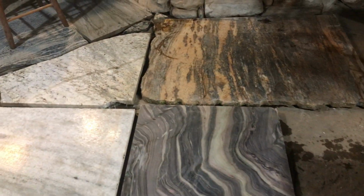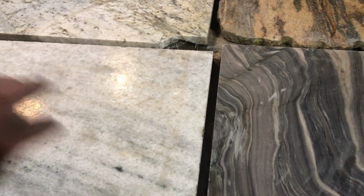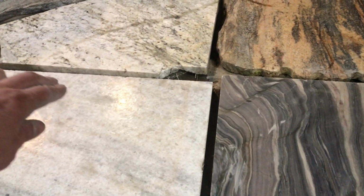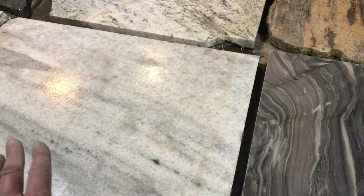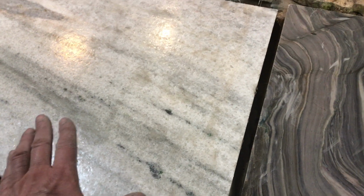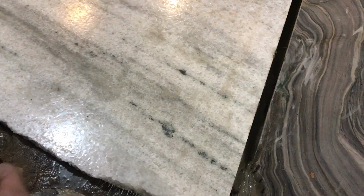But then, once you get it close, then what I do, down here, I first flip the stone up. I have to hold it with one hand. I water down the area with the other hand. And then I scoop out my mortar and I start making little piles. So on this one, I'd probably make 6. And then I gently let it down. You gotta be careful, don't want to hurt your back. The good thing is, once the mortar's underneath, it doesn't come down fast. So you have time to move your fingers out.